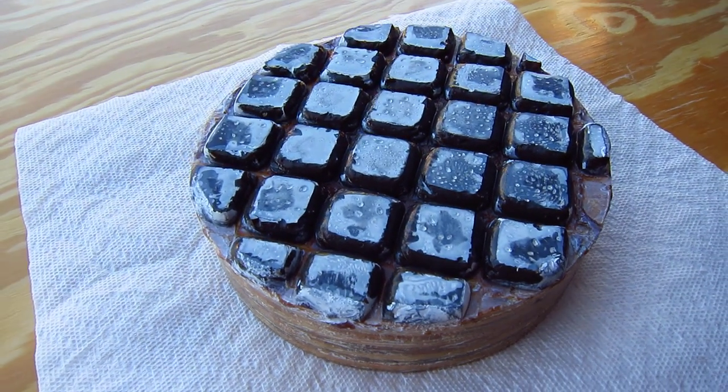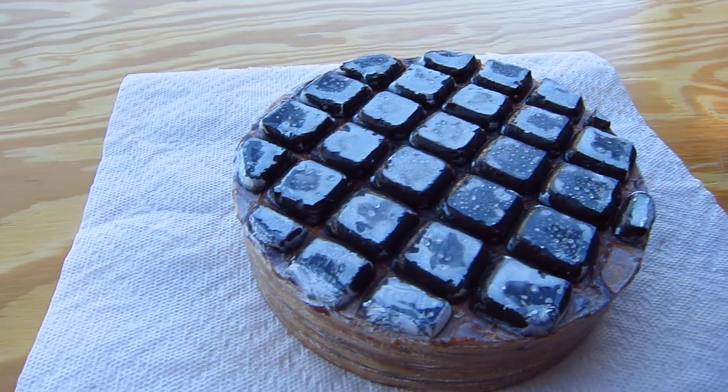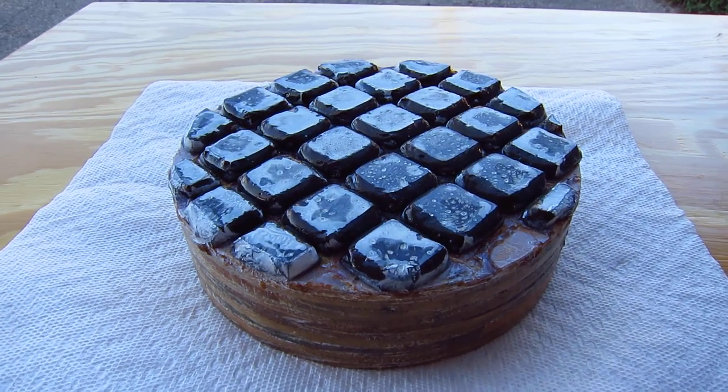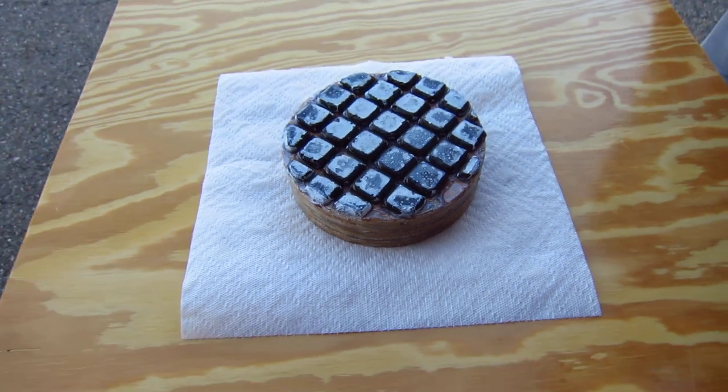Right now, it's actually okay to use this lap, but I wanted to show Dimitri how you trim the channels in here, so that these things actually do move and conform to the surface of the mirror as you polish out or figure the mirror.